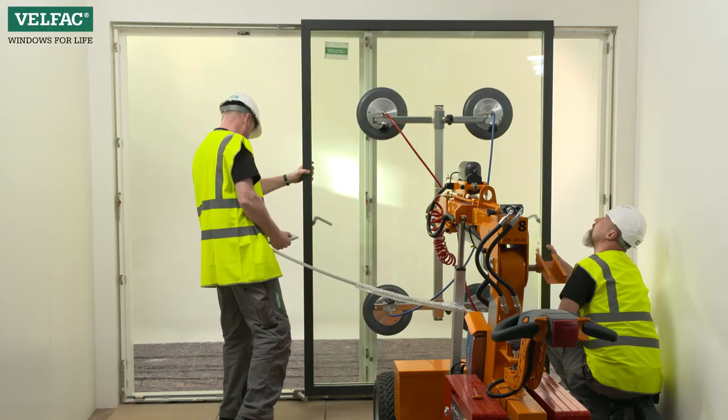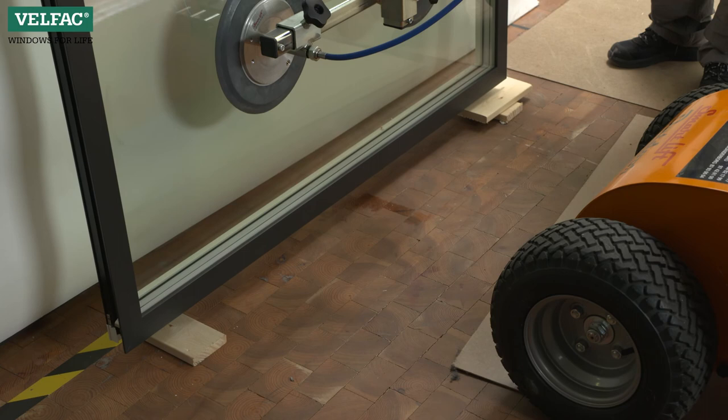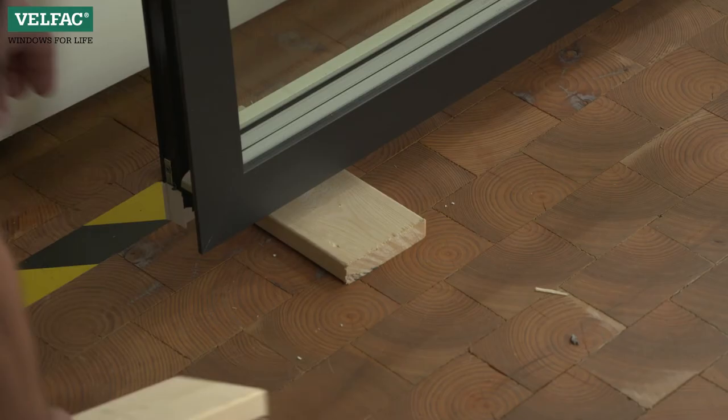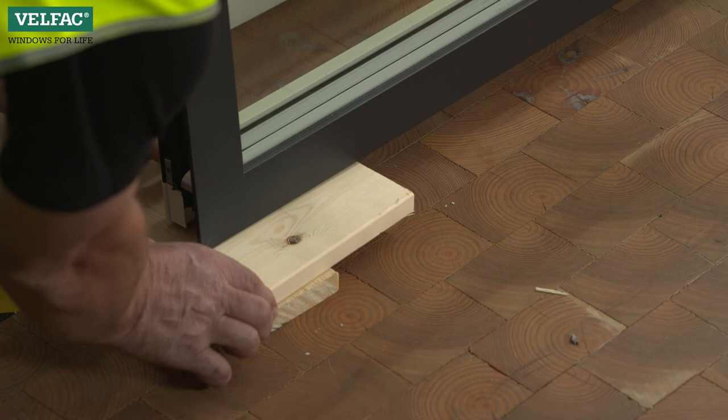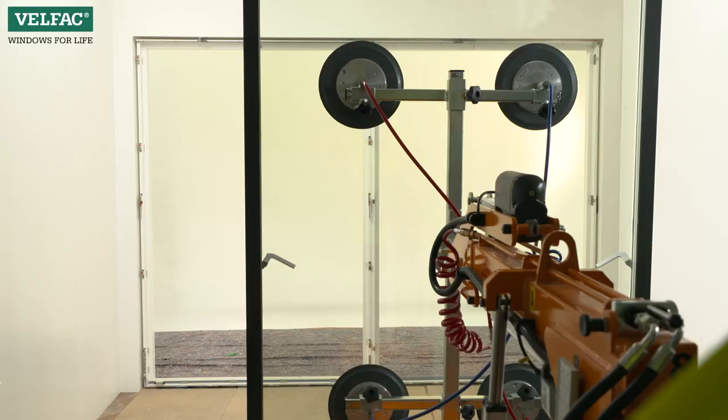Gently lift the sash slightly upwards and free of the guide rail. The sash must be stored in an upright position and must be packed off a finished floor to prevent any weight being applied to the plastic profiles that form part of the sash.